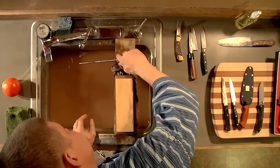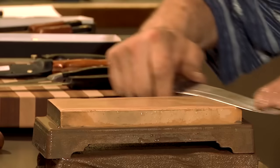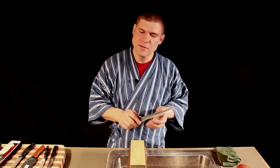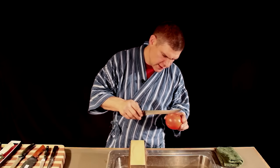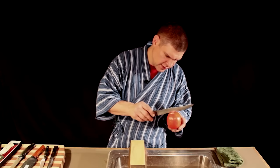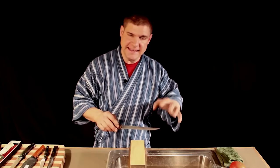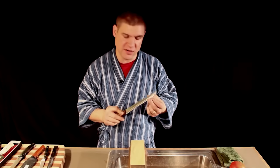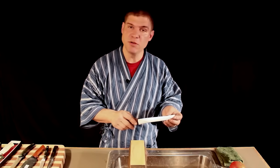Okay, so burrs. Okay, well, to my 3 fingers, it feels razor sharp. To the tomato skin, we've got to cut there. There's a part that wasn't cutting before, it's cutting now. Now, it doesn't quite cut as aggressively as other places. Sometimes that's reflective of the metallurgy. Sometimes, by the nature of the way the blades are heated and then quenched and then tempered, you could have some places in the blade that are a little harder than others and a little softer than the others. I'm suspecting we got one spot here on this little knife where maybe it was left on a burner on a stove once, and then maybe it got a little hot, or maybe when it was made there was a soft spot there.